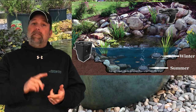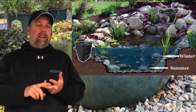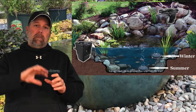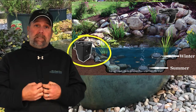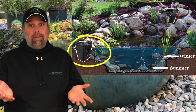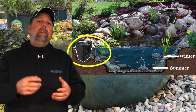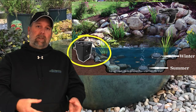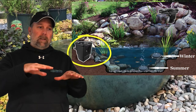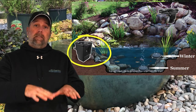You're going to have probably a check valve in there or some kind of connection that goes to your plumbing line from the pump to the plumbing line. You want to disconnect the pump, pull your pump out of the skimmer box. And before you can even get to the pump, I forgot a step, you need to take out that skimmer basket, and you're also going to have a filter pad in there as well as a filter pad brace that's on there keeping your filter pad.